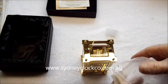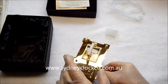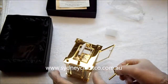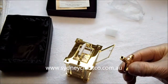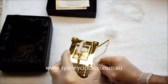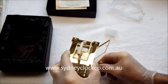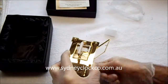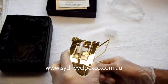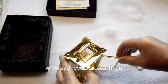These clocks are 8-day mechanical clocks with a dual lever platform. So winding the clock is a matter of once a week, popping the larger end of the key in and giving it the appropriate amount of turns — about 11 and a half full turns to wind after it's run down.